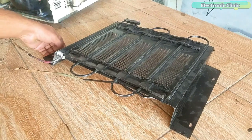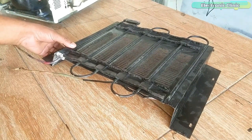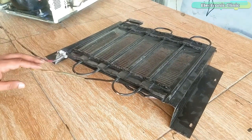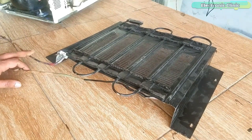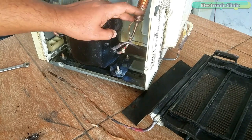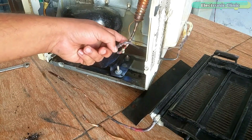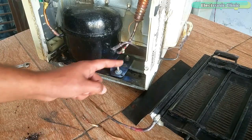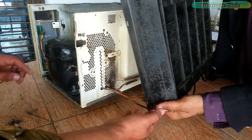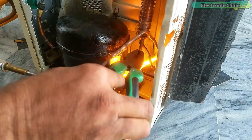This is the refrigerator condenser and it is one of the main operating components that make up the cooling system on a standard refrigerator. As the refrigerant passes through the evaporator plate or freezer plate, it collects heat energy from within the refrigerator, leaving the inside cold enough for food and liquids. Its size selection depends on the compressor size. I did make a mistake — I had welded the filter dryer directly with the discharge pipe of the compressor. So I will remove the filter and weld it with one of the pipes on the condenser, and the other pipe of the condenser will be welded with the discharge pipe. So the condenser is placed between the filter dryer and the discharge pipe of the compressor. The condenser is fixed on the backside and the filter dryer is now welded in the correct way.